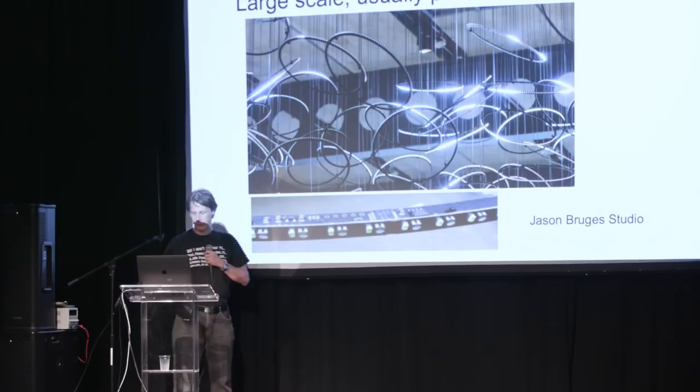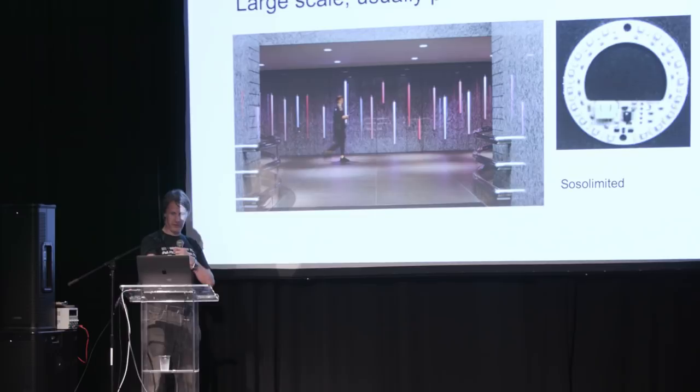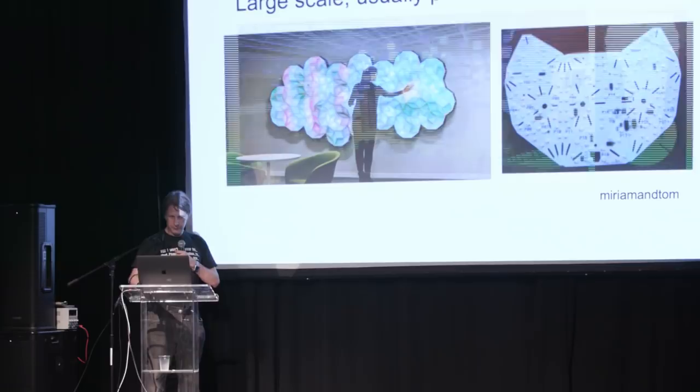What I'm going to be talking about is what I've basically done for my day job the last 10 years or so — generally large-scale LED installations, architectural stuff, art, retail spaces. Just a few random selections here. These are some RGBW LED rings, about that diameter, all made out of PCB. These are some custom LED boards mounted on the end of acrylic tubes for single-pixel vertical tube installations. These are custom LED assemblies that went into big square boxes to provide large fixtures — I've actually done a YouTube video on the design of these.